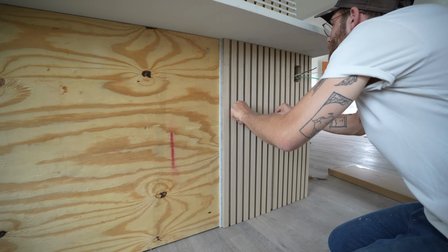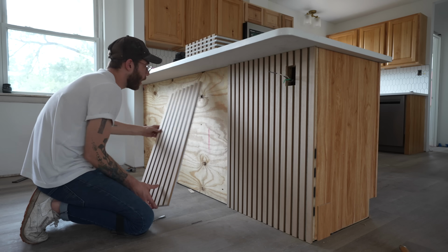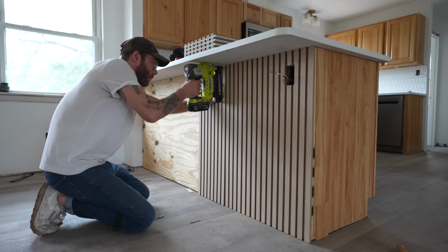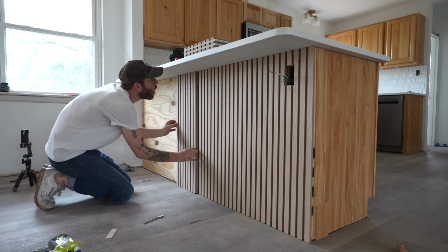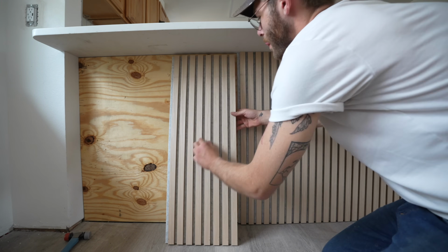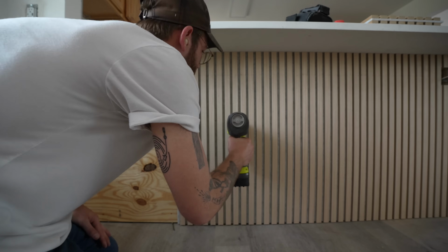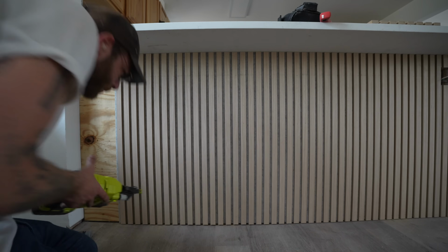The panels butt up edge to edge. On the left side, there's a felt line exposed, and on the right, the wood and felt are flush. That way it's a seamless, continuous look. In other installation videos, I've seen people use drywall screws through the felt and into their substrate, but I like the idea of using the brad nails instead. I think using any color screw on this color felt will be super noticeable.